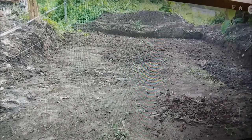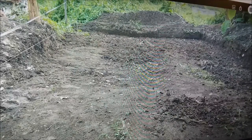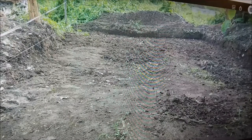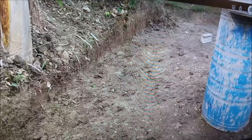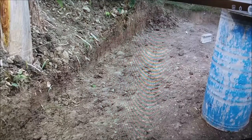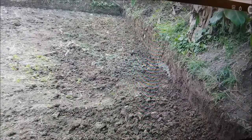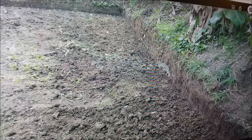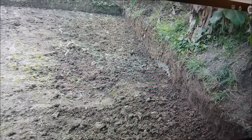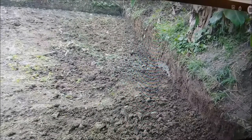This is the site preparation for the first shrimp tank — it's the one behind the house, outside the living room. You'll look right out the living room at the water. The strings are the form clearance rather than the size of the slab we're about to pour. There's a string around the outside showing the shape of the concrete. We never gave them dimensions for the form clear line, so on one side they'll just take out eight inches more dirt past the string. The exact placement isn't critical — it's just a hole in the ground.